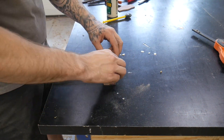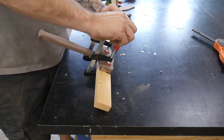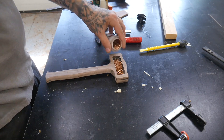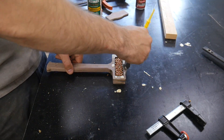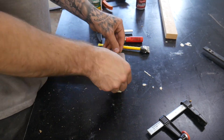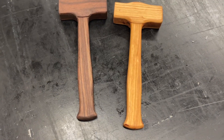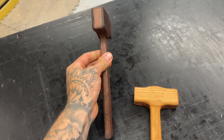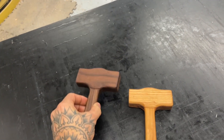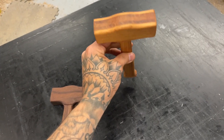To give it some more weight and the dead blow oomph, I added some BBs — just off Amazon and relatively cheap. I filled the walnut mallet with as many BBs as I could, and it actually doesn't feel quite as good as the cherry mallet with a little less. So I think about three quarters full of BBs is the perfect amount.